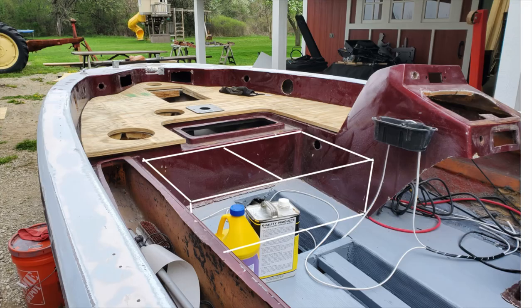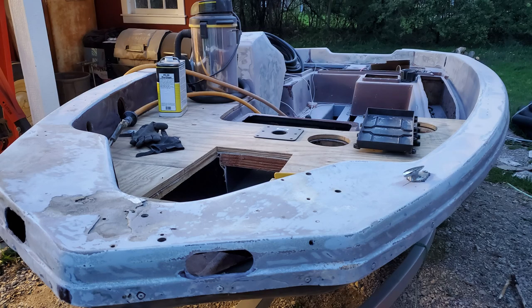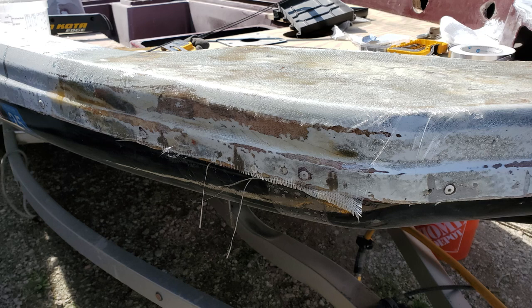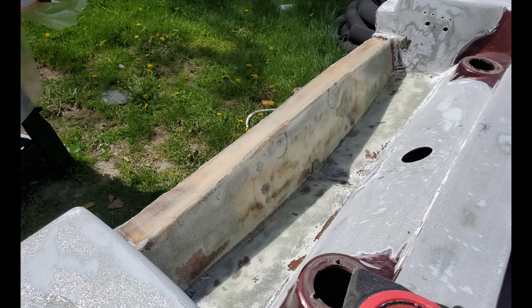At this point, I continued stripping paint and doing some rough carpentry work to update the floor plan. The bow deck would be expanded to take better advantage of the floor space for battery storage and also for a dry locker, which would also increase the usable area of the casting platform. All this woodwork would later come out so it could be fully sealed and glassed with penetrating epoxy. At the bow, a lot of work was done to remove a thick layer of fairing compound that was hiding hull damage underneath — two large cracks that needed proper structural repair, built up and reinforced using several layers of biaxial glass mat.